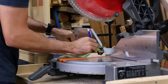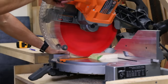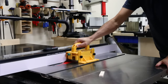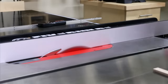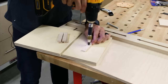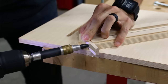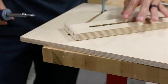To hold the back end of the pieces while cutting the tapers I'm using a small tab that's going to be attached to the back of the fence. I had a little solid maple block laying around and cut the board down to 3 inches long, then went to the table saw and cut 3/8 inch strips from that piece. I cut a few extra in case the first one gets torn up on the jig. To attach the tab I pre-drilled and countersunk some holes, flipped the fence over, and transferred those holes to the back. That small tab is a little shorter so when it's attached flush with the top of the fence it leaves a gap underneath for sawdust to escape.